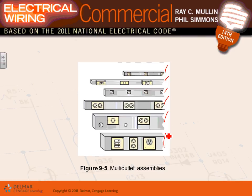For multi-outlet assembly, the same thing, Derek. Can it go through a partition? Yes. What's the problem then? Can you put the partition right here? If the partition is right in here, no problem. You can partition it at these areas as long as you don't have a device right through the partition. Does that make sense? Any comments, any questions, my friends, about multi-outlet assembly?